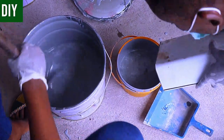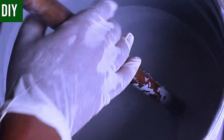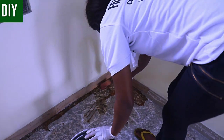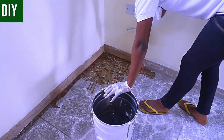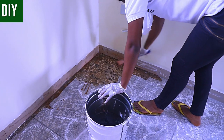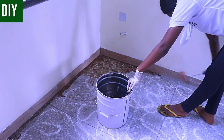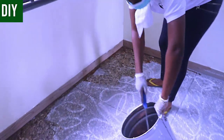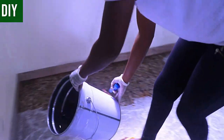Once you've properly mixed Part A and Part B of the Prim 100 epoxy, begin to apply using a paint roller in forward and backward strokes. Primers should be applied lightly — think of it as applying glue to the sole of your shoes. Cover the entire surface area, every inch of the floors you intend to coat. Here we prime a terrazzo and a rough tile floor surface.